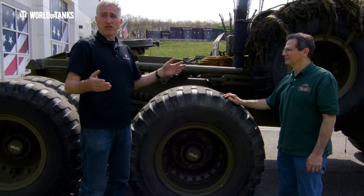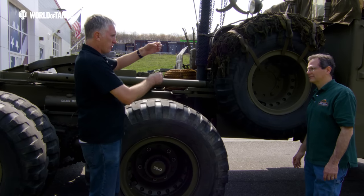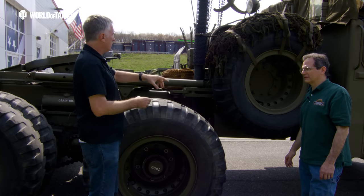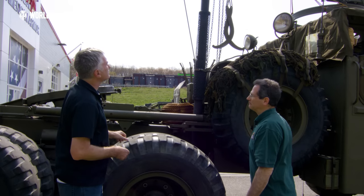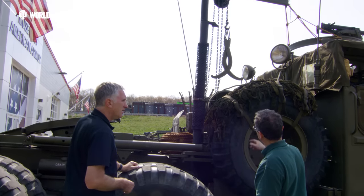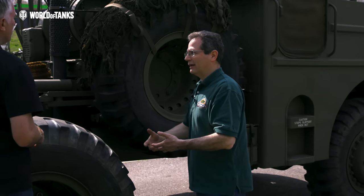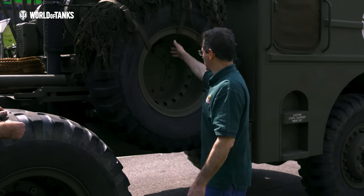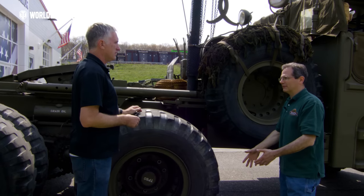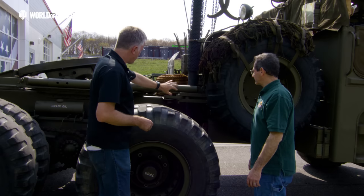This is an incredibly complicated vehicle. There's a big spare tire. On the far side there's a jib crane mounted with a chain hoist on a trolley and lifting tongs that come down off it. The lifting tongs go around the tire and pinch under it — when you lift up, it applies more pressure on the tong end. You can support the weight as you unbolt the tire, then gently let it down and roll it into place.